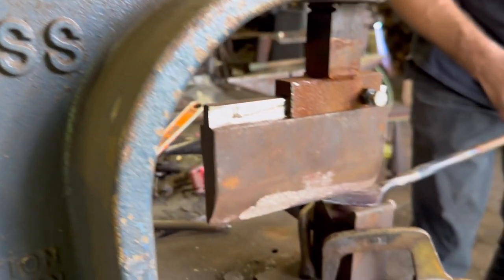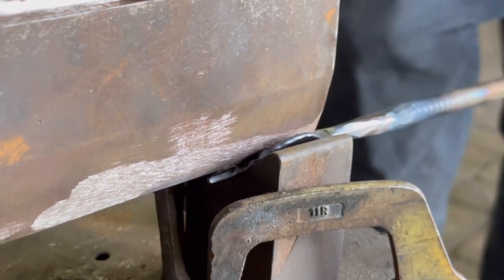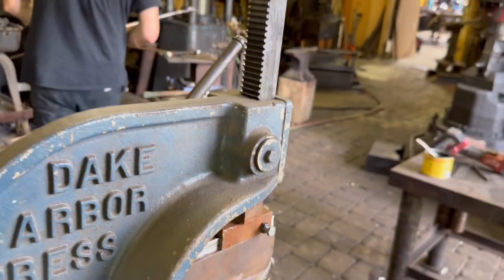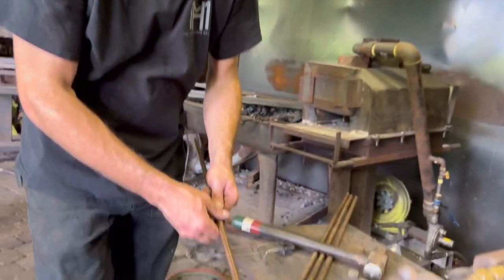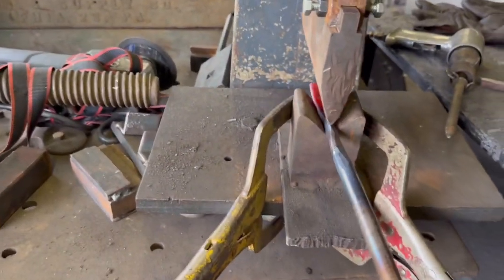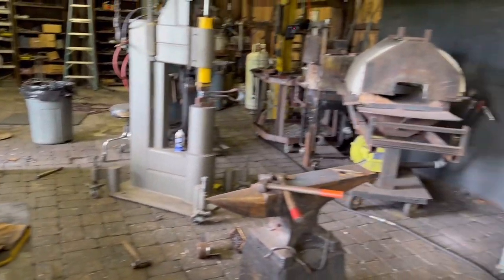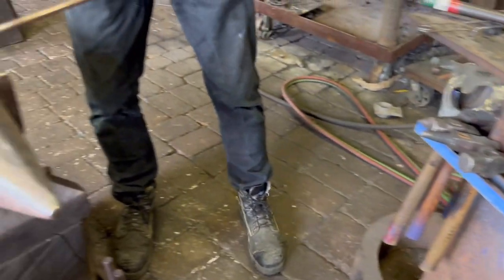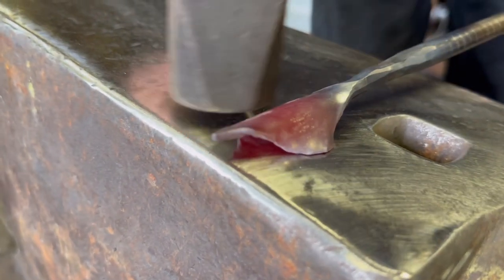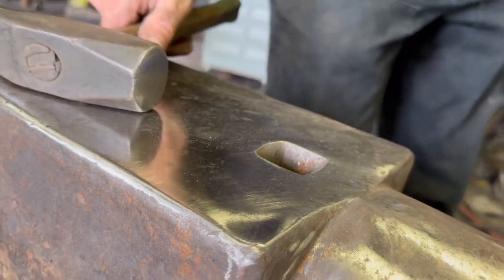This is a very low red heat — you can just barely see red in it. I'll come in and press that to help shape it. I'm going to go back and press it one more time, just to feed it into the die a little bit deeper. Be very careful. Now I want to keep the center vein but fold that leaf out a little bit, so I'll do that by hitting on the edge to let that cup out and create a beautiful transition.